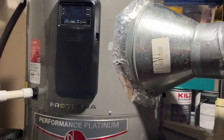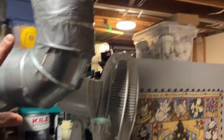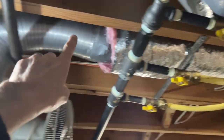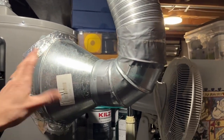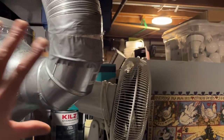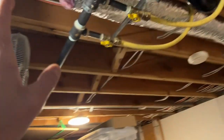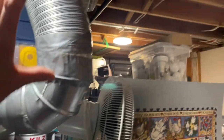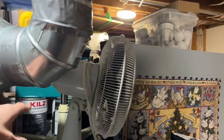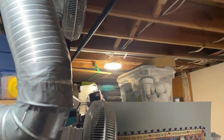I had done some changes — that's what I was making this new video for. I used to have insulation all the way down here, wrapping it all in rock wool inside aluminum foil, which seemed like a great idea. It's not a good idea. I kept it so insulated we were getting massive condensation inside the line. Now we're getting none, because the insulated pipe was causing a severe temperature transition, and we were dripping off the piping at multiple points. So I took off all the insulation.